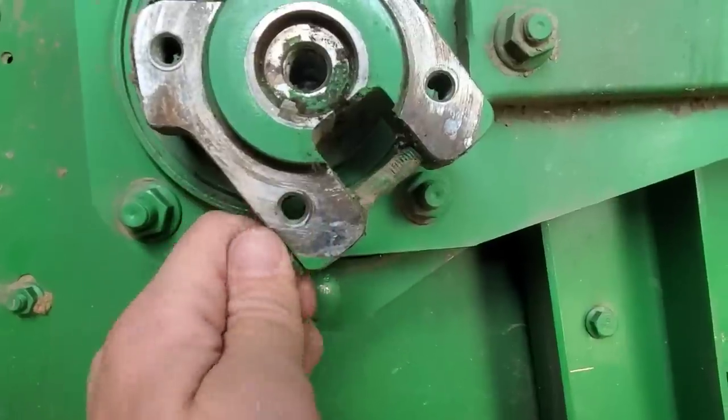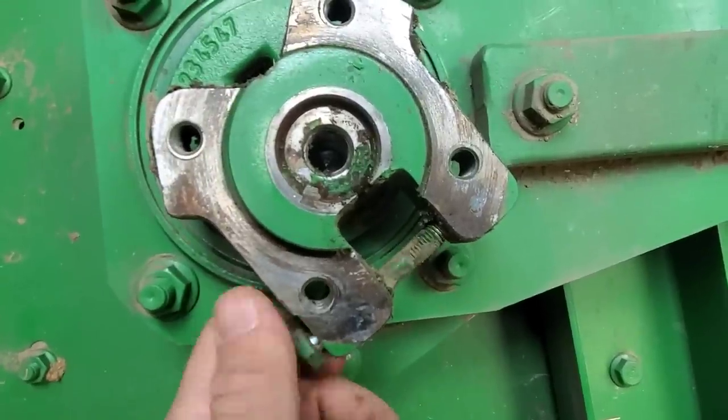Well, I know what the problem is. Unfortunately it's Sunday — I don't know that I'm going to be able to get a part; it's pretty unlikely. But we can take it apart and see what we got. If it's possible we've got a bearing on hand — highly likely we don't, but we'll see. It's the bearing that drives the shaker arms on the sieve frame, real close to where we replaced that arm the other day. That bearing was not out when we did it because I looked very closely at it. So whether it was damaged when that bushing went out in that arm, or if it's a new problem, I don't know. But we know what it is, we know how to fix it, so we just got to tear it apart.